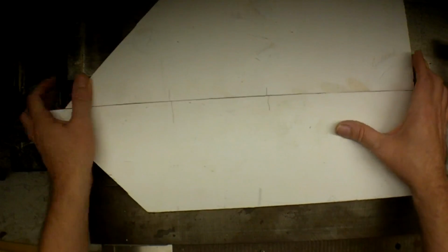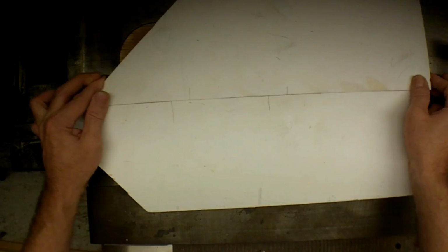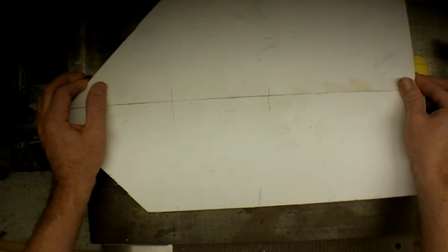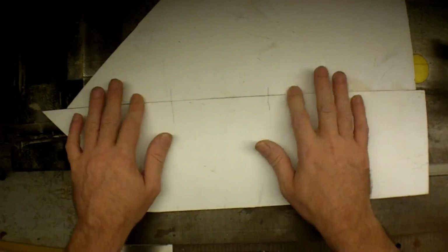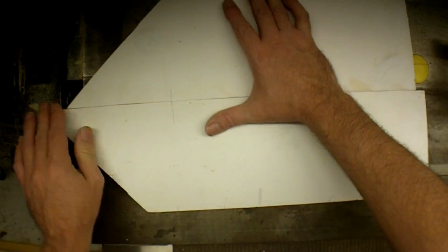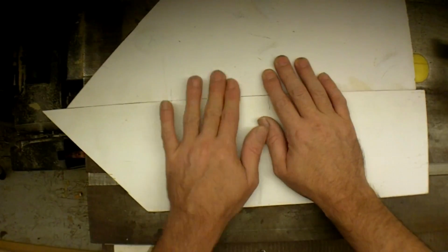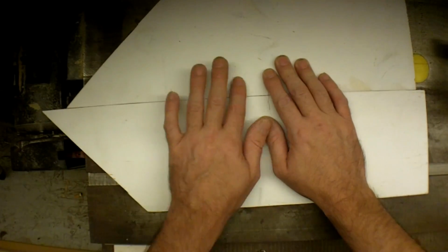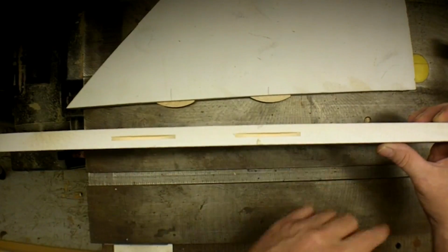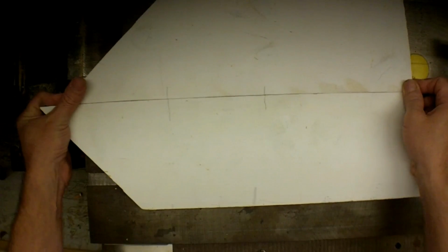So just slide them together, and you can see my registration marks. You can see how much lateral movement I have in these. I don't know, maybe an inch in either direction for this particular number. It feels, like I said, these boards are not ultra flat and they're not jointed on the ends, but that's a nice transition across these 2. I can just barely feel it at all. So obviously, you'd edge glue your biscuits in and then put it together and clamp it, but all in all, it's going to work for my purpose.